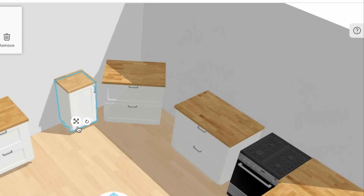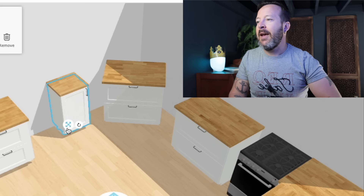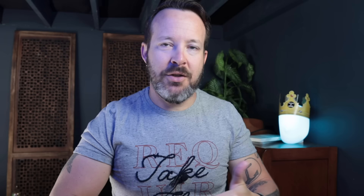The first thing you can do is take a shallow base cabinet. Maybe you have a section of cabinets where you want a corner and you can't have regular depth cabinets for whatever reason. So you tuck that base cabinet right to the back — it's a full-depth regular size cabinet on a 45-degree angle — and next to it you take a 15-inch deep base cabinet, or even a wall cabinet mounted on the base, and put it up next to it. You'd use fillers to connect these together, but you can see here we have this beautiful section we can now create.